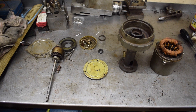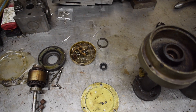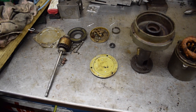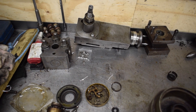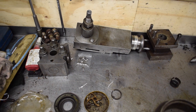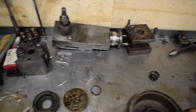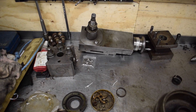The pump has been stripped down now — the bearings aren't fantastic and the seal isn't great either, so I've got to get a couple of bits ordered. In the meantime I'll clean it all up and make a new gasket for the top. This is also the top slide that hasn't been seen in many of the videos — that needs work doing to it. I just need to measure the new bolt I need to make, but the top slide itself is all cleaned up and put back together, so as soon as I've got the bolt drawing done I can put this back on and we can make the bolt.